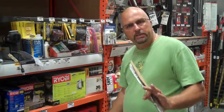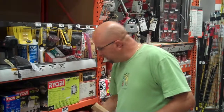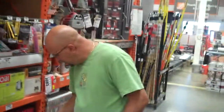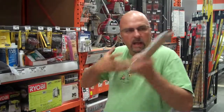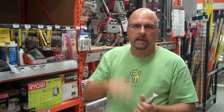Only a few guys know how to do all three steps. The sausage rollers — what we call rough painters — they just push paint. A finished painter works with the rolling, comes in with a brush, tightens it all up, and sprays. That's a finished painter. The final painter is the guy with the caulking gun — he rolls paint, finishes all the touch-up, makes sure he uses tape so not to damage the building, and caulks it all around. Those are the three levels of painters we're going to train as we go along.